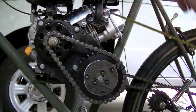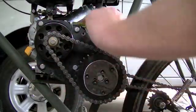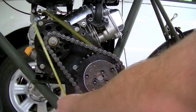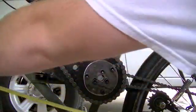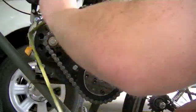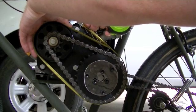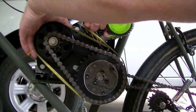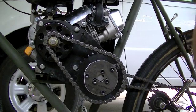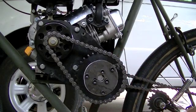We need to get basically the length of material that we need — it's sort of a long oval circumference. Just take the tape measure and kind of bend it around a little bit. It needs to go around the outer diameter of the clutch. I'm showing 27.5 inches, and that's obviously a tight fit. I'll probably leave that piece of aluminum diamond plate full length, bend it how I need it, and then cut it off. We've got to have some clearance — at minimum a quarter inch, I'd like a half inch.